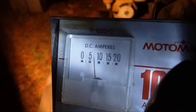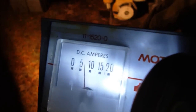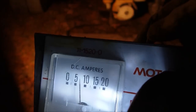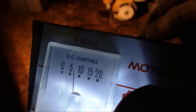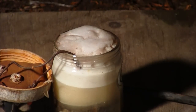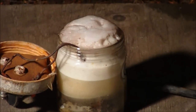With no catalyst at all, the urine is drawing a noticeable amount of current. The plates in that HHO generator are spread quite far apart and it's not very well built. This doesn't mean a dry cell HHO setup will automatically work with this — the resistance is probably going to be too low, so your plates will need to be spread further apart. While these things are running, you're always worried about it popping, because all it takes is one spark and it's really loud when they go off.